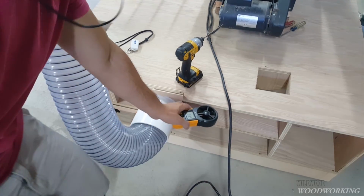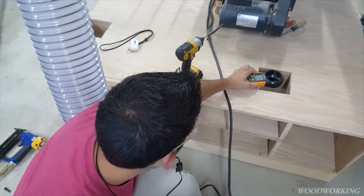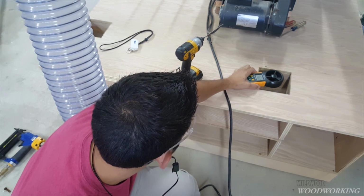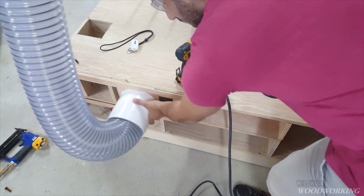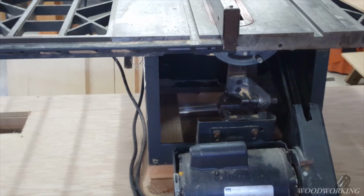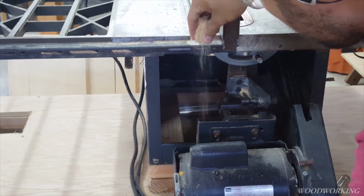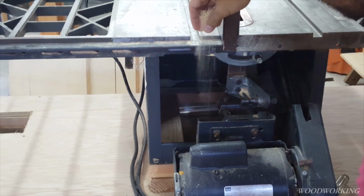Switched it up to the first dust collection port, and it just got to 1000, so I lost 200 CFM with just using the tin turn. Yeah, I could improve it, but I wanted 1000. 1000 was the minimum for a table saw, and that's what I achieved. It's probably not the best angle, but all that sawdust got sucked straight into the port and went right into the cyclone.